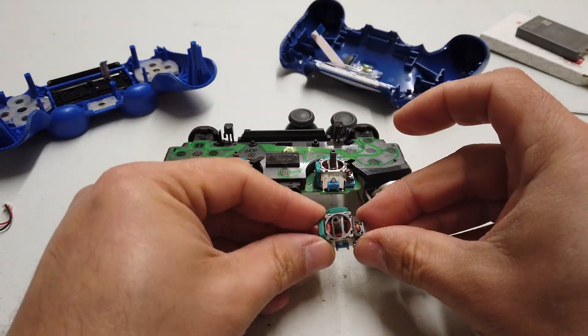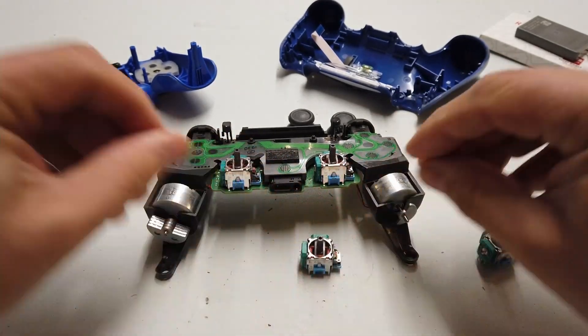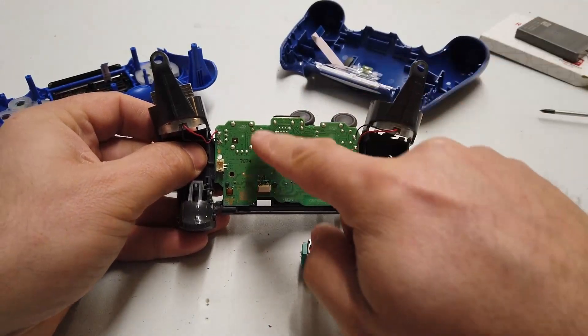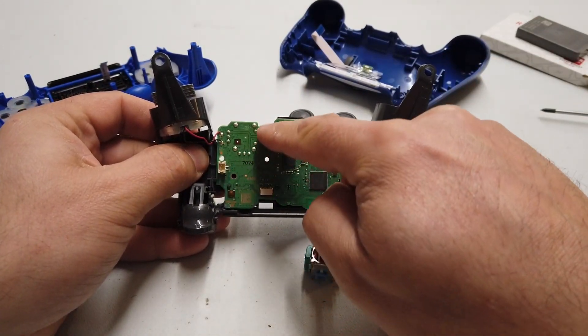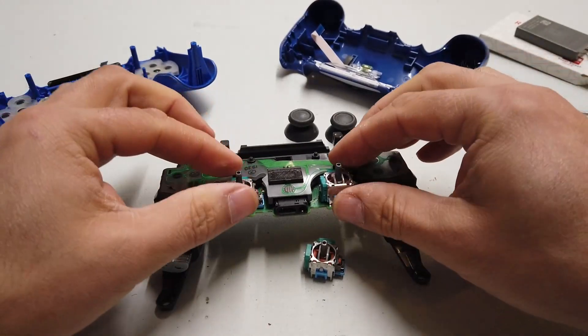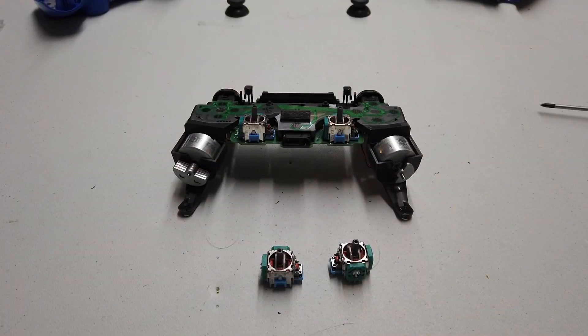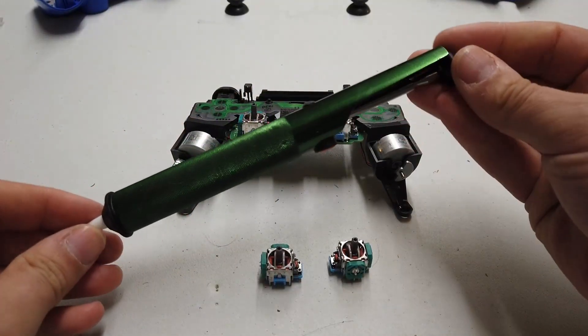Let's double check what we've got here. That all looks good — doesn't look like it's going to be too much of a hardship. Just a bunch of desoldering work to do here on the bottom of the PCB, and once those are desoldered they should just pop straight off the board. In order to do this you need a solder sucking tool.